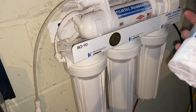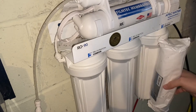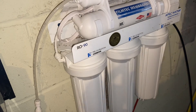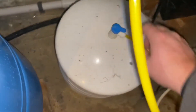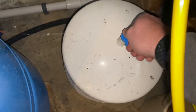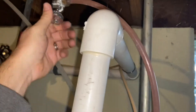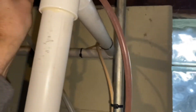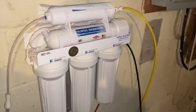The third one is labeled one and says ten on it — that's the sediment filter that goes in first. The first step is to turn off the water. There are two spots: turn it off at the tank so it doesn't push back — just a little turn — and also where the main water comes in. Turn that off as well so you don't have to worry about water spraying out.